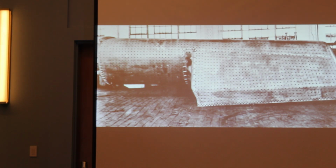Then what they typically would do is, if the tubes are 18 feet long in one class of locomotive, they take them out, clean them up, safe end them, and maybe put them in a little shorter locomotive. But over time, they keep cutting off the same end all the time. So if a tube has a safe end, they would safe end onto the safe end. You might get pieces that are this long or that long, and they keep adding onto the one end as they cut the other end off, and that's where you end up with, well, a maximum of 3 supposedly, but N&W kind of cheat a little bit.